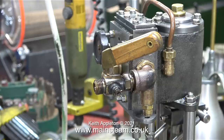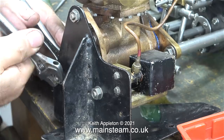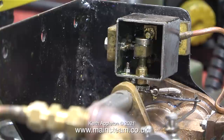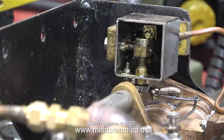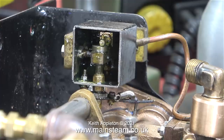On the steam inlet to the steam chest there's a really big handle that operates a steam inlet valve. In my opinion this tap is in a very bad position, so when I send it back to the owner I'm going to remove it and put it in the box so it doesn't get broken. Now it's time to put it all together — I'm bolting the pump to the base and connecting it to the oil pump. When I connect the reciprocating arm to the oil pump it needs to be in another hole so that the arm moves more. When I do that everything's fine and the mechanism of the oil pump is working perfectly. Apart from making a brass lid for the mechanical lubricator, that's about it.